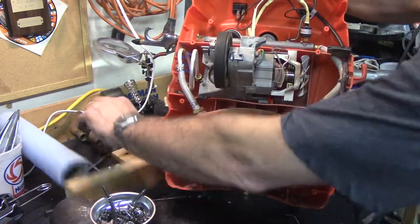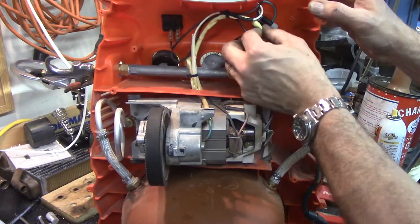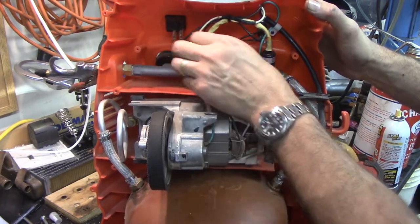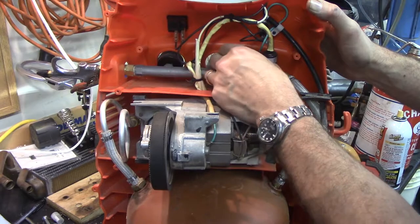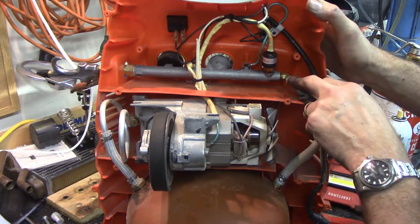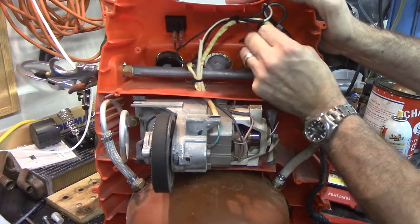This is all made into one piece. Pressure from the tank goes to a pressure switch which turns the compressor off and on, and it's grounded in several places. They're using this manifold as a ground — the power cord ground comes in, grounds to this manifold, and then this big ground goes down to the motor. That's kind of interesting. This all looks like pipe thread so we should be able to rig something up. Let me get this thing apart and see what I need for pipe and fittings. I can go ahead and unplug this pressure switch.